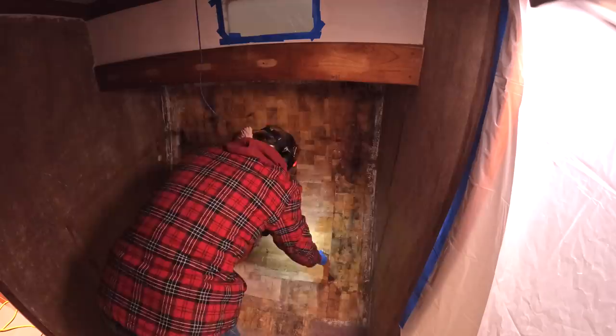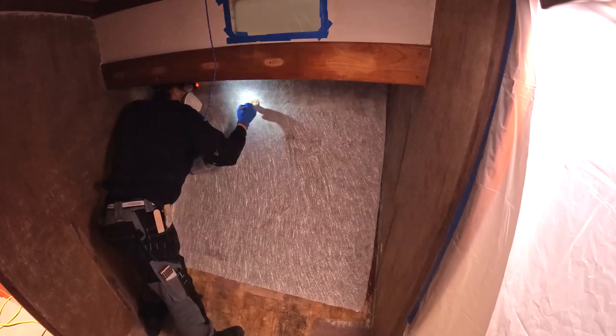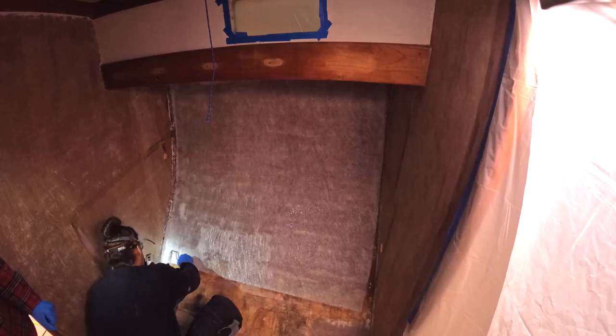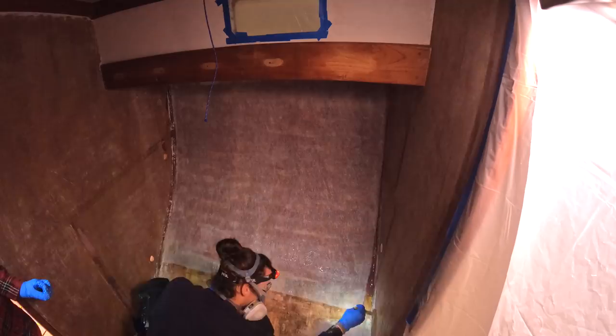By now, Aladino and I have our fiberglassing routine sorted out. Aladino applies the glass, and I keep him supplied with a steady stream of freshly mixed epoxy. This is helpful because mixing all the epoxy at once may cause it to cure too quickly. Smaller batches, one at a time, make the work far less stressful.